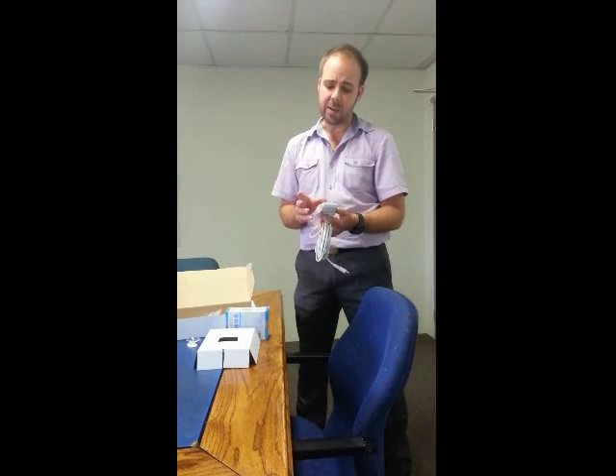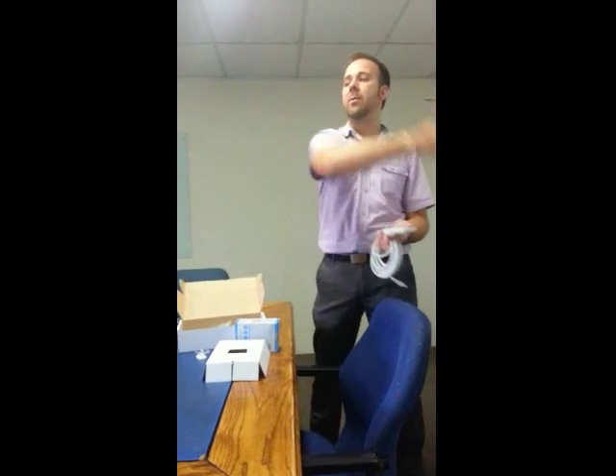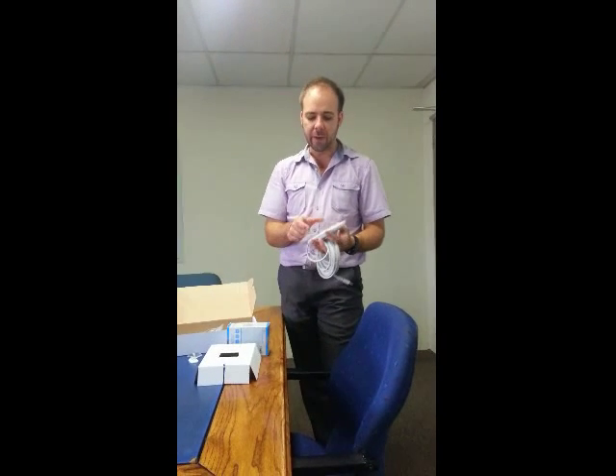This is the first time we've combined the antenna and a modem together in one enclosure. In the GSM 3G environment you don't often see this happening. In the Wi-Fi environment you see it where you have a modem, router, and radio card with the antenna - that's where we learned it's better to put the electronics with the antenna. So it's almost an active antenna or an integrated modem, all in one. There's a short RF cable that goes from the modem to the antenna, so the signal loss is minimal - it's not a long cable. If you had to put the router inside, you'd need a 10 meter cable to get the antenna outside. With just a short RF cable, the signal strength is really good.